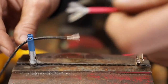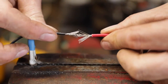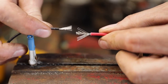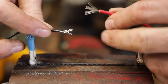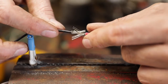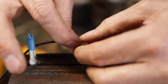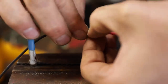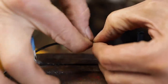For joining the wire, there's a couple different ways of doing it, but what I have found to be the best, and this is what Granddad always did, is you fray the ends of the wire like this. You splay them out and join them so they intermingle, mesh like fingers together. Pinch one side like this and start bringing everything together, and then twist. Twist this side here, and then twist this side over here.